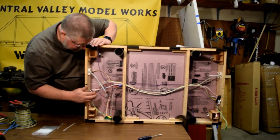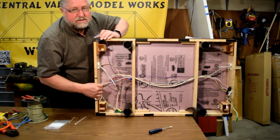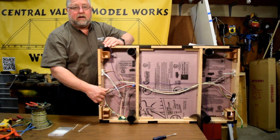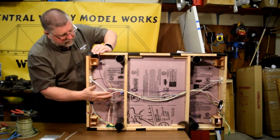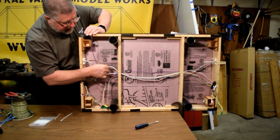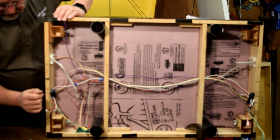Now at this end, you'll notice we didn't put anything on the detection bus. It's sitting here by itself, not connected to anything, because like we said, we only want to connect in one location between the track bus and the local detected bus. So that's all the big wiring we need to do.